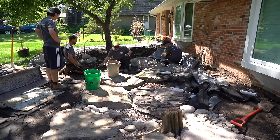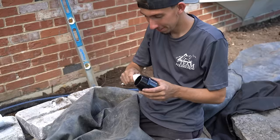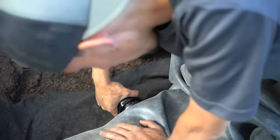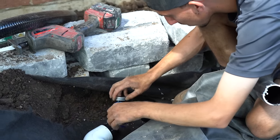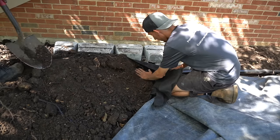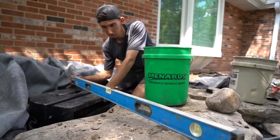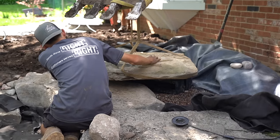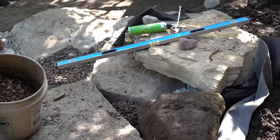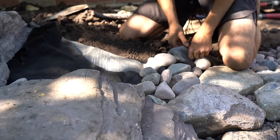Once the foam's dry, it's really like concrete — good for life. Here's Jack getting ready for the plumbing to come into the back of the spillway. You just put the spillway right wherever you want the waterfall to start. When tightening, we only go hand tight — you can almost thread it all the way in, but if you use a wrench you can over-torque and split the bulkhead fitting. Here we have to use an elbow because the flexible pipe isn't flexible enough to make that turn between the spillway and the wall. Then pack soil around it to keep everything tight. Jack uses a little gravel to level the bottom and get it to exactly the elevation we want, and then we'll come over that spillway with another flat rock so the water almost looks like it comes out of a cave. We foam that whole little pocket, mixing big gravel with little gravel so it's not all the same look everywhere.